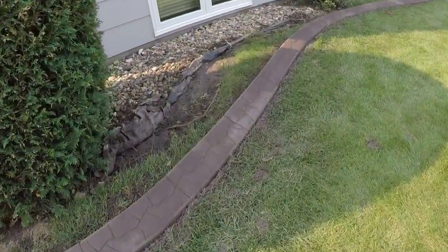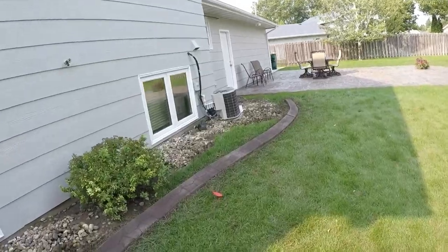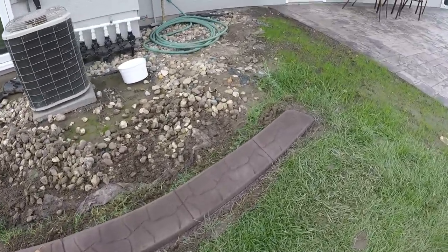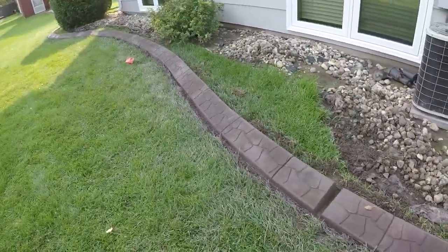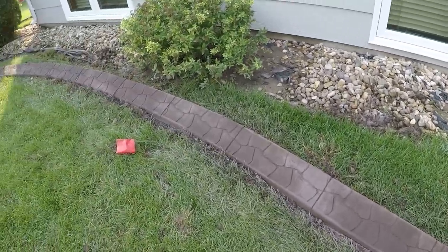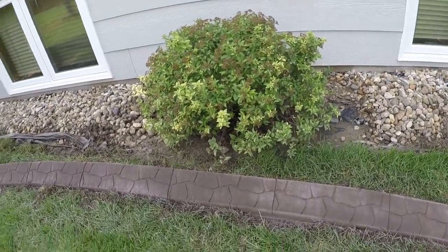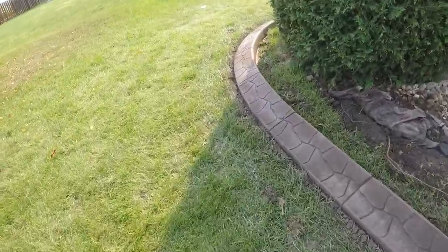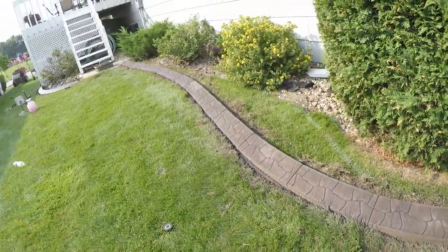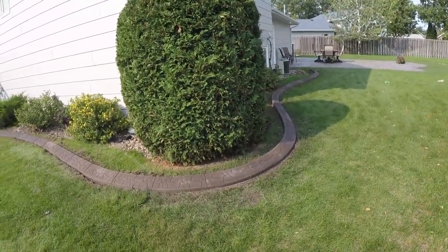This is about 20 minutes ago and you can already see that it's starting to evaporate. This is in the shade so it's going to take a little bit longer. But as long as the curb isn't wet you can seal it, because that residual amount of paint thinner on there will evaporate right through the sealer. If it is actually wet, that sealer could run down, and because it's a solvent, it could cut the sealer and make it thin and actually run down the front of the curb. Typically when you're done with every job and you have some sun or wind, there's no problem sealing any of this.